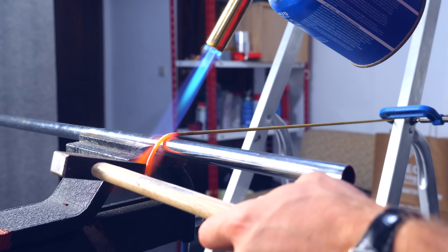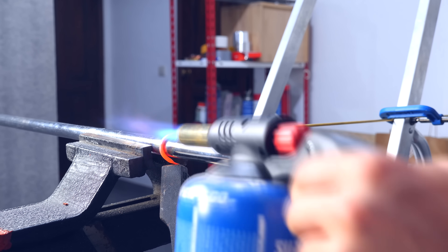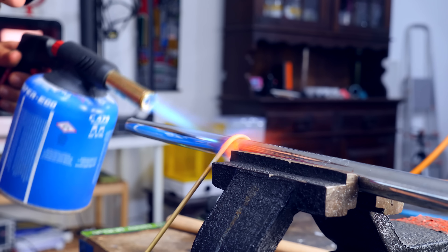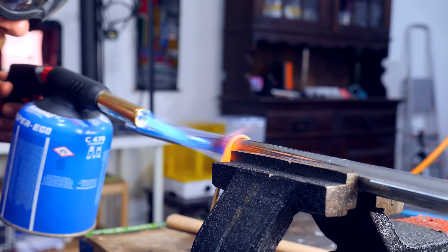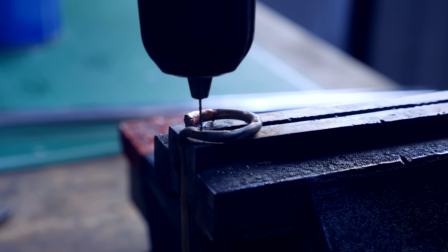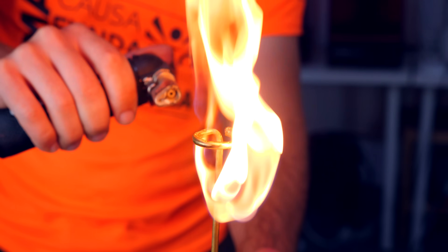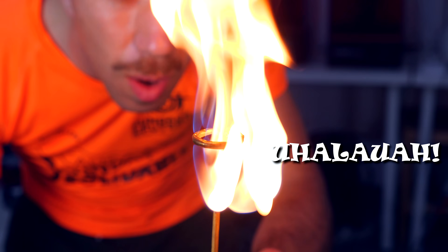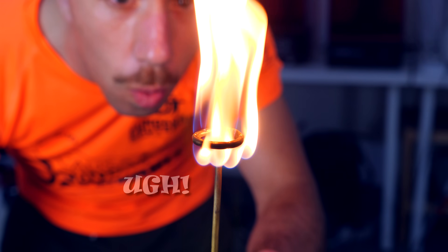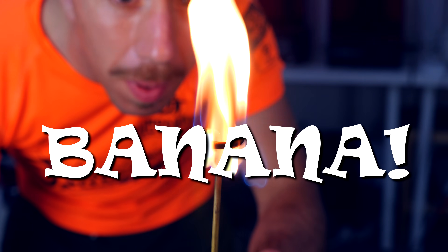What wasn't pretty easy was making the fuel line slash injector. I had to bend the brass tube using the power of fire, and it's customary for me to mess this up. The reason I have to bend it is so I can use only one continuous tube to guide the fuel and disperse it into the flame tube. To disperse the fuel properly, I drilled five one-millimeter holes.